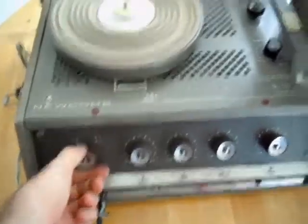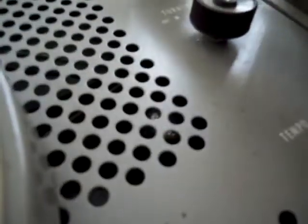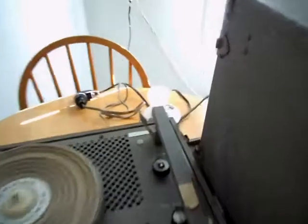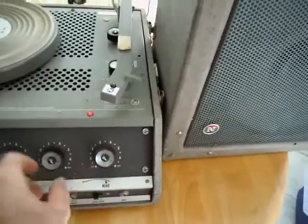Let's see what happens. The light bulb got bright for a second and then got dim — that's a good sign. Peering down in here, got filaments glowing up here and there, that's good. The bulb's starting to light up a little bit, which probably tells me the high voltage is there. You can hear a slight hiss from the speaker, but no noise.